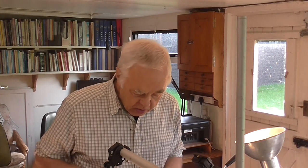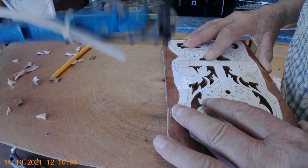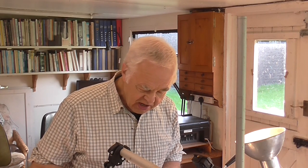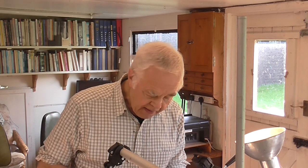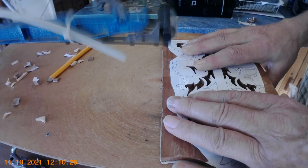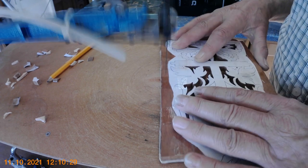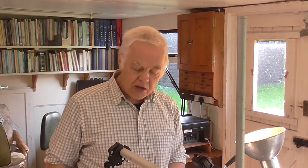When you're new to fretwork you'll find the work will jump and bounce about. The faster it goes the more it will do it. You soon get used to that. Beginners find it annoying and often use the hold-down tool that comes with some cheaper saws, but my advice is take it off - it gets in the way. You naturally hold it down as you're working; it just becomes second nature and it won't bother you eventually. Occasionally it will jump up when your concentration goes or it catches on something, but generally it's not a problem once you get used to it.